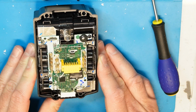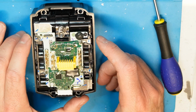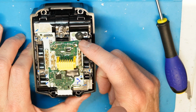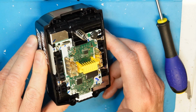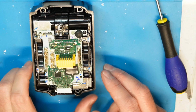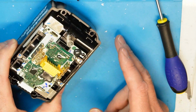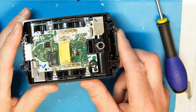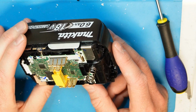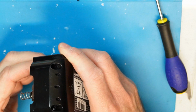And also we can see between the cells the BMS, which means between two cells you have a balancing port that is connected, so it can also check the difference between the cells, not like the fake battery. So there is a very huge difference between this and all the fake batteries you buy on AliExpress, which I don't recommend using, because in case of a short or disaster, you have a big difference from this battery.